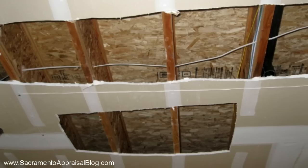If your eaves look deteriorated, that's definitely a problem unless you've just replaced your roof. FHA is going to require at least two years of lifespan left on the roof. I see this issue frequently where a homeowner has cut into the garage firewall and compromised it. In this photo the cut is on the garage ceiling with the master bedroom right above it — if a fire starts, it's going to spread very quickly.